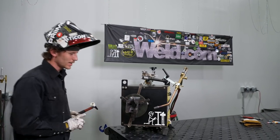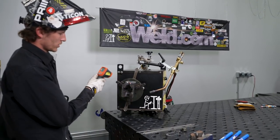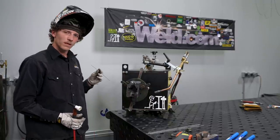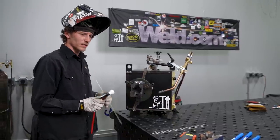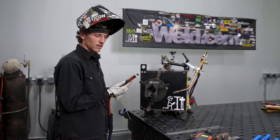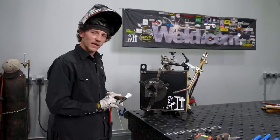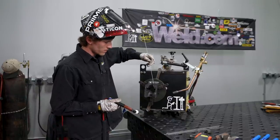We've got the whole piece preheated. What are we looking at on our weld spot? 400 degrees — that's perfect. We're going to be utilizing the 2.4 millimeter Anviloy weld rod. We're also utilizing the E3 2.4 millimeter tungsten with the MK14 cup — large gas coverage. We want a lot of gas coverage on this thing, so we're going to start right here and fill it up.